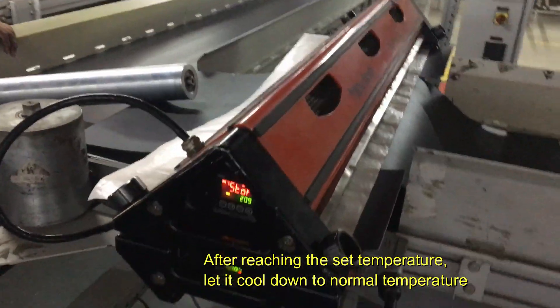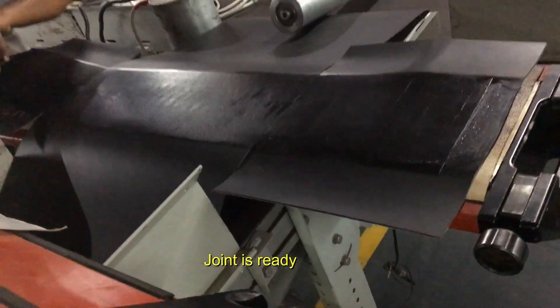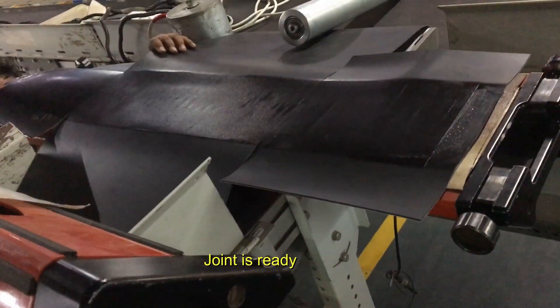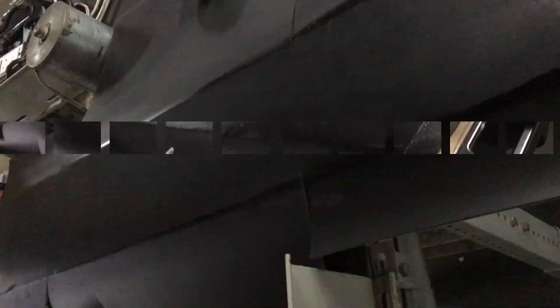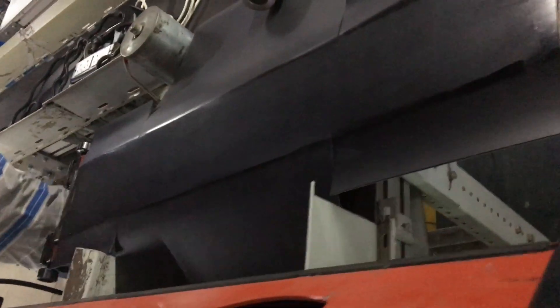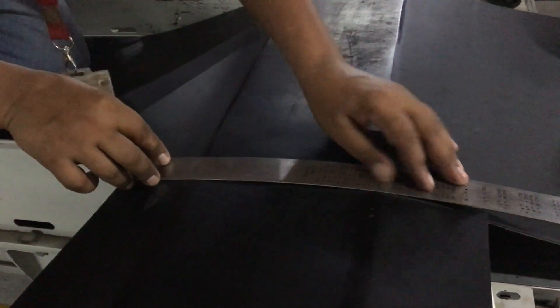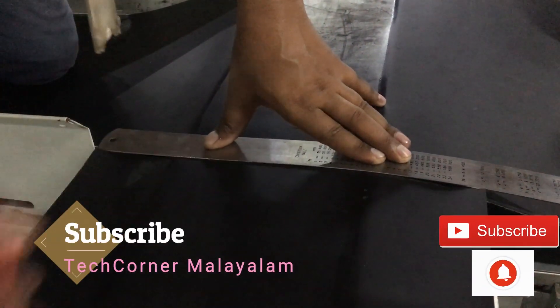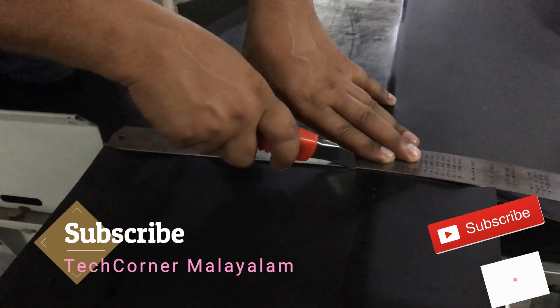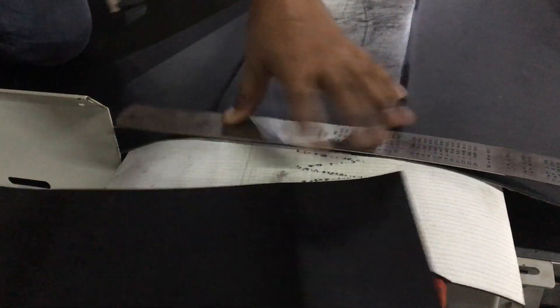We will open it and start the joint. If we cut the belt on the side, we will join the correct belt. We will join using the hot vulcanizing process and splicing. We will also cover mechanical joints in another video.